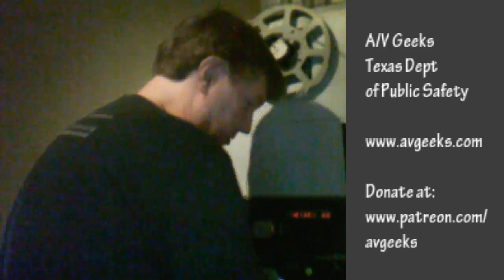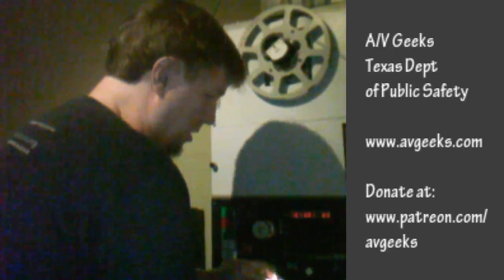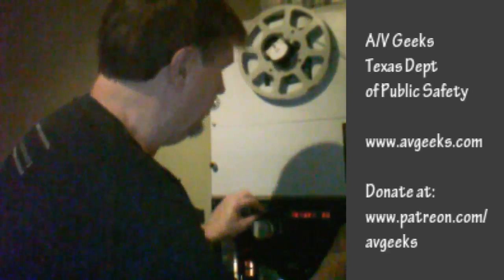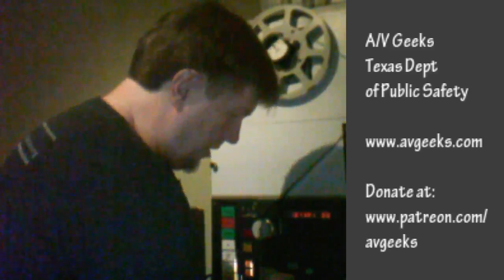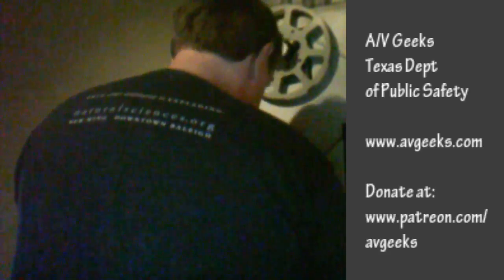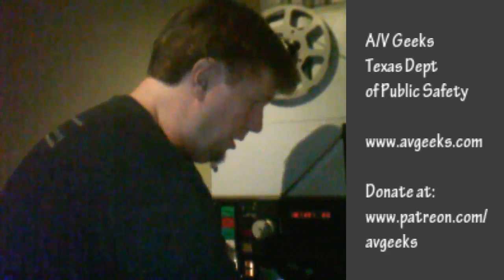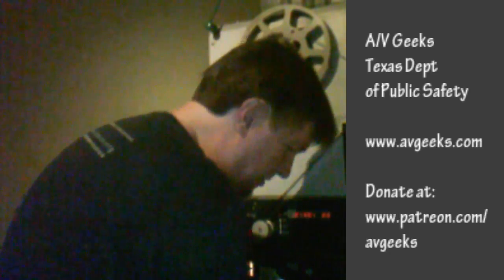Anyways, I have to re-thread this. That's a disadvantage of this telecine, which is it doesn't use perfs to go through. Wait a minute, I'm a little discombobulated. Right. It doesn't use perfs, it uses tension, and when it loses tension, you have to go through all these rollers and make it all work nice and right. Which is why, if the sprocket hole is damaged or shrunken, you see the image roll instead of chatter. So that allows you to see the film without damaging the film anymore.